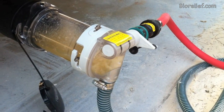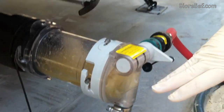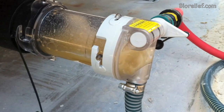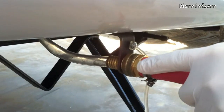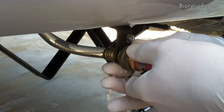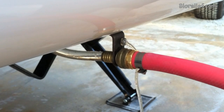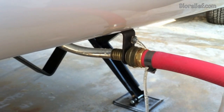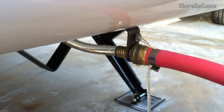That didn't take very long at all — it took about three to four minutes to drain out. We know it's drained because we have all these white bubbles going down here. So my next step is I'm going to flush out the tank. I've got a turbo tank jetter right over here. I'm going to go ahead and turn that on and add some water to my tank to clean it out. So now this is flushing out my tank. This is not part of the Sewer Solution, but I like to do this anyway just to get things cleared out.